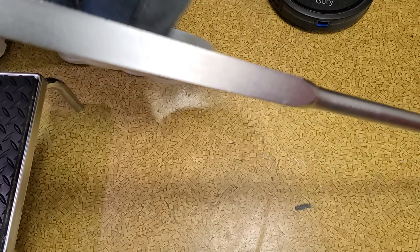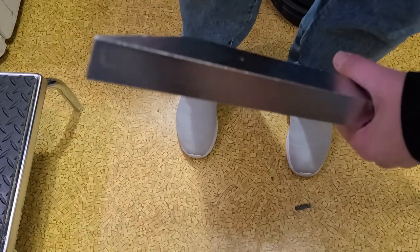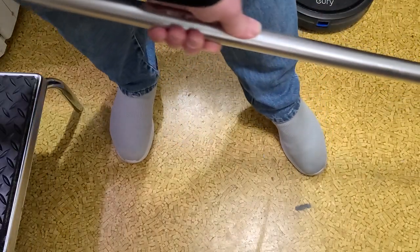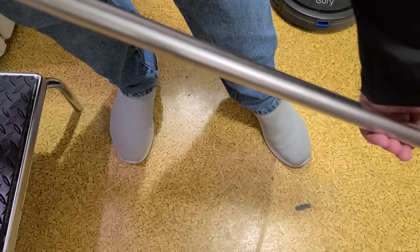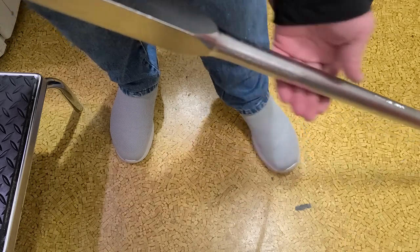It is forged, although what I'm suspecting is it comes as a 1 1/4-inch square stock. It comes from a rolling mill. And so the rolling mill, that's a forging process because they're upsetting the material to get it down the size. I suspect they may be doing some kind of roll forging where they heat up the back part and run it through a couple of very high pressure wheels to get the round handle.